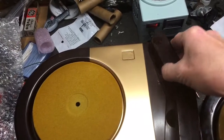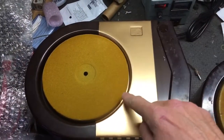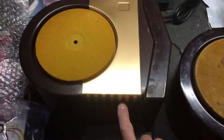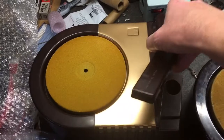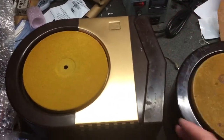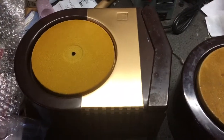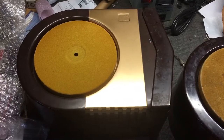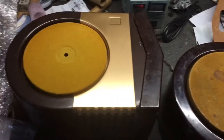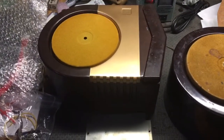These are interesting players — there's a switch built into the tone arm. When you pull up on the tone arm, it activates that switch and the turntable starts to spin and the amp turns on and warms up. And then all you have to do is just drop the needle and play. They're pretty basic: there's no record changer, no automatic shutoff. You just play one record at a time and do everything manually. But they're really good little players — they sound great, and you'll see and hear all of that as we go along.